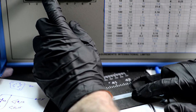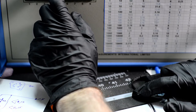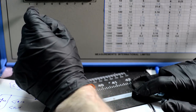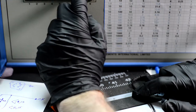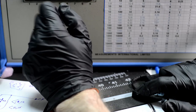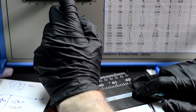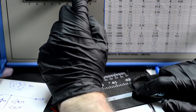And what we can do is, now we can quit, because we're done with this measurement, and set the resistance ratio, and our RS is 1000 ohms, 0.3470, enter. Now we want to have the set density for PVMs, we'll leave at zero because it's just a calculation. And first we want to set the current, so let's go back.